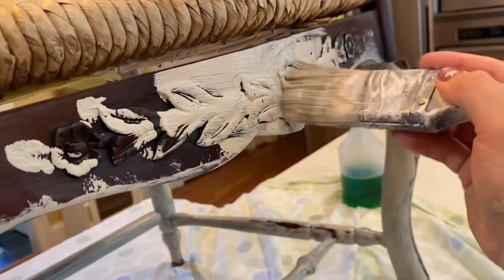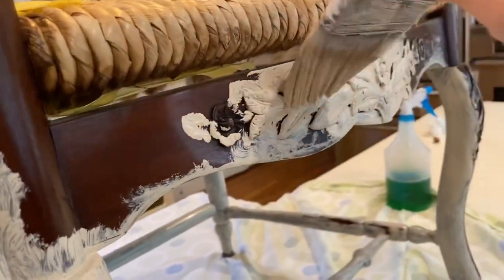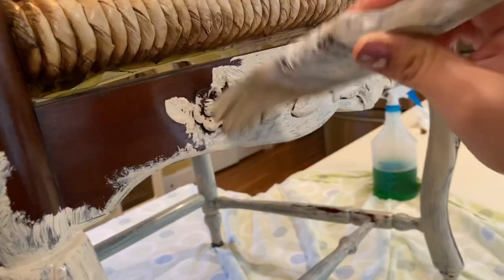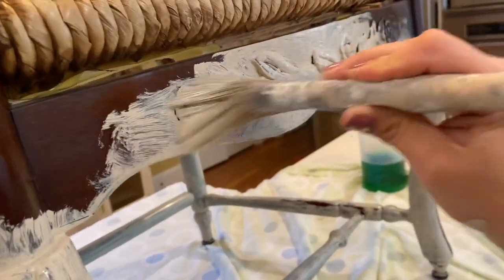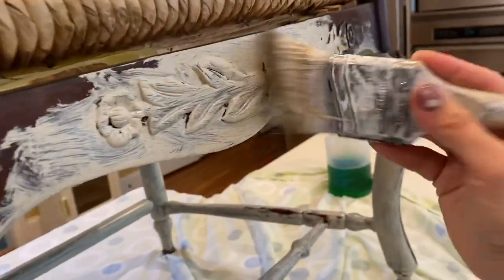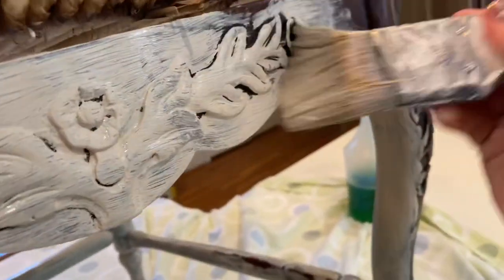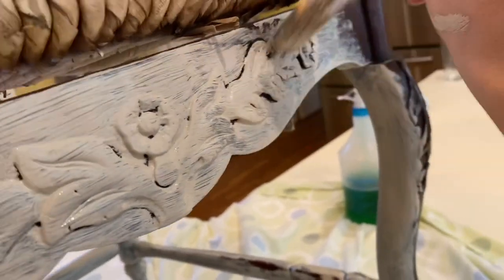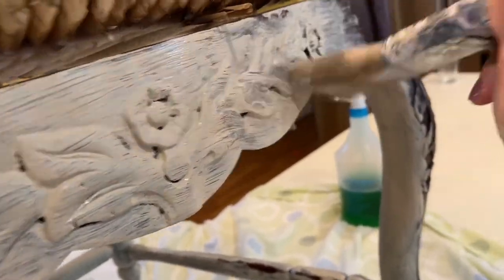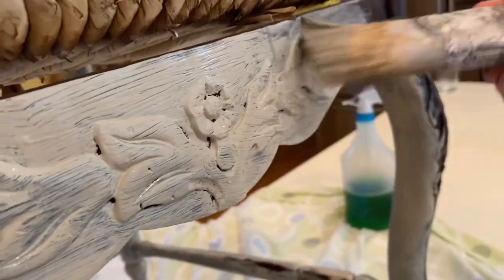In this video, I'm not going to show you how I paint it with the Sherwin-Williams paint or the Mindful Gray color, because it's exactly like I would paint with the primer. So I just follow the exact same steps, and if you're lucky and they tint your primer for you, you may only have to do one coat overall and maybe just two coats extra in certain spots.